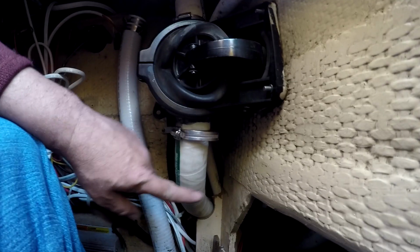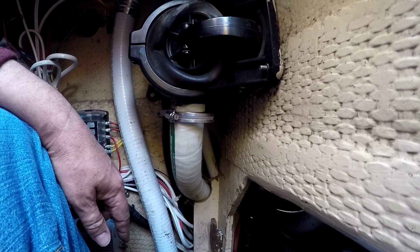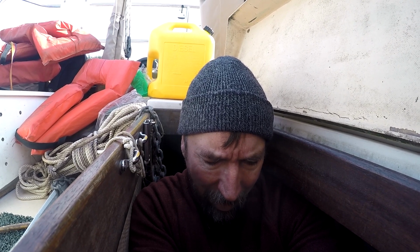That holding tank is no longer used, so really what we want to do is move this pump to the bilge and drop that into the bilge instead. We're not going to do that now because that's going to be a nasty job. Anyways, that's good to know. So we've got to make some design changes. It's okay that this seacock is actually closed off. It opens up some questions about how to lay the boat out with the porta potty installed.